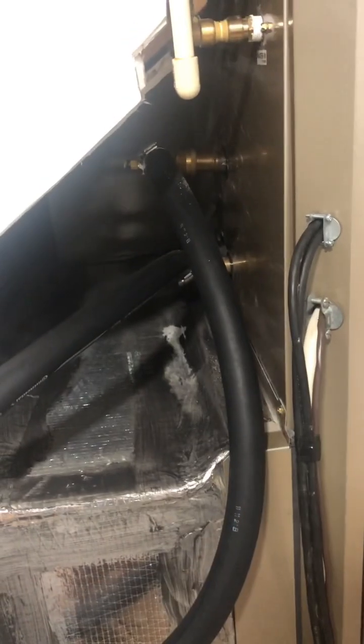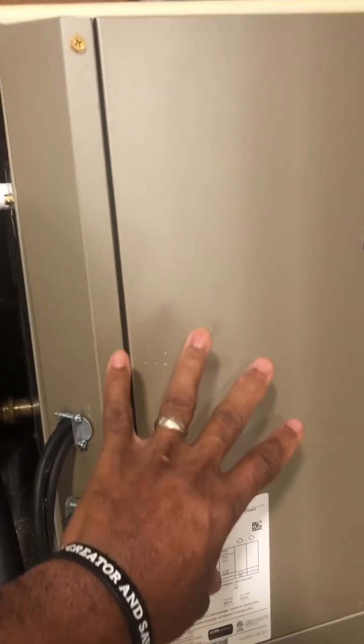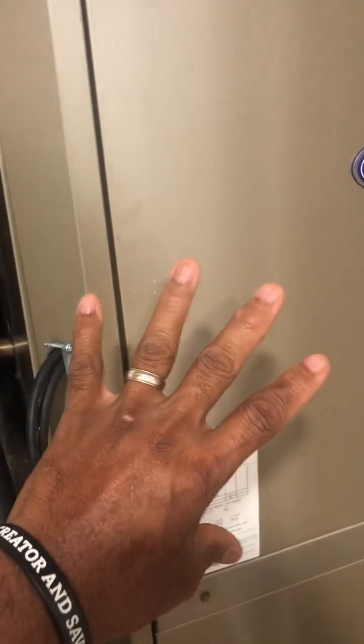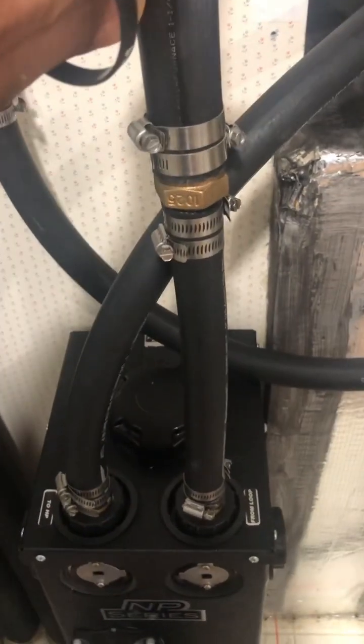As you can see here, in the summertime these things work efficiently. Inside is a condenser compressor that would normally kick on if this was just a conventional air conditioning heat pump unit, but by being geothermal, the house is cooled by the 55-degree temperature fluid that's in this system here.